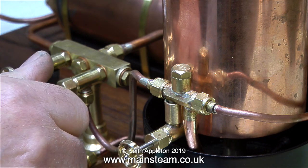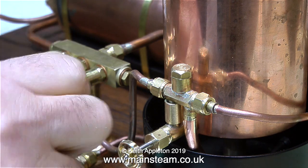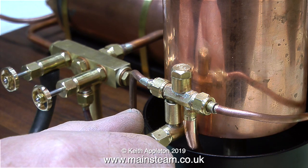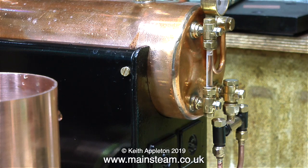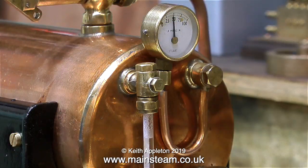It's time to test the injector. First, the injector needs to be cool — steam cannot condense in the water if the water is really hot. Because the injector is connected to the live steam pipe, and the short copper pipe connecting it to the turret conducts heat very well, it gets very hot. So I open the water valve, let the water run for a while, then open the steam valve, and start to back off the water. Then it makes a wonderful slurping noise, which means the injector is pumping water into the boiler, accompanied by nothing dripping from the overflow.